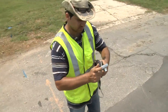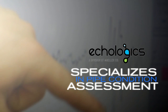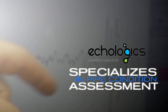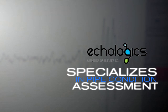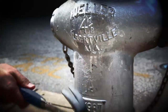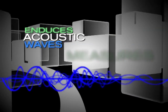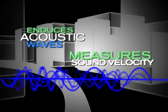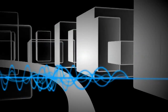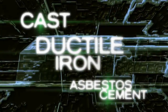This way it can be fixed and we know exactly where to dig. EchoLogix also specializes in pipe condition assessment using the same non-invasive techniques to obtain a thorough evaluation of the pipeline's structural integrity. By creating a noise outside the area spanned by the two sensors, EchoLogix induces acoustic waves in the pipe and measures the sound velocity. As the pipe loses structural stiffness from corrosion, the acoustic wave travels slower. It works on all types of pipes, including cast and ductile iron and asbestos cement.